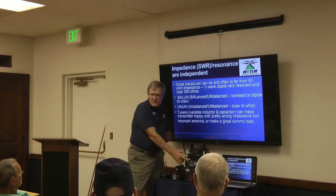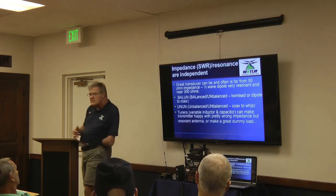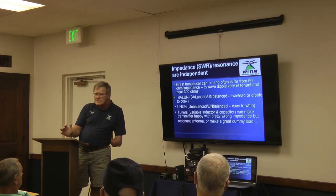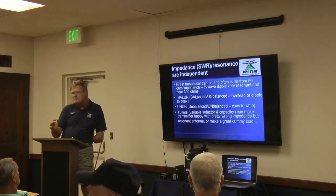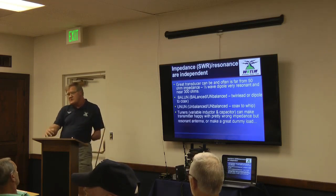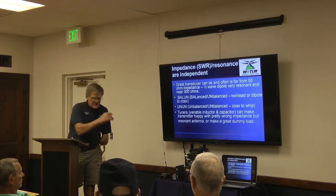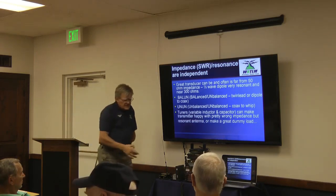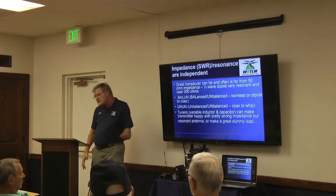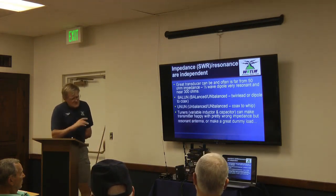That's what I really like about the 929. It has a really sophisticated measurement capability that shows complex impedance, SWR, capacitance, inductance, how much inductance and capacitance it's switching in, where it's switching in, and you can change it if you want to fiddle with it. And they cost about the same amount of money. I think the 929 is currently about $239, covers all the HF bands, and I'm not going to do a lot of recommending, but if you're looking at tuners, look at that guy.